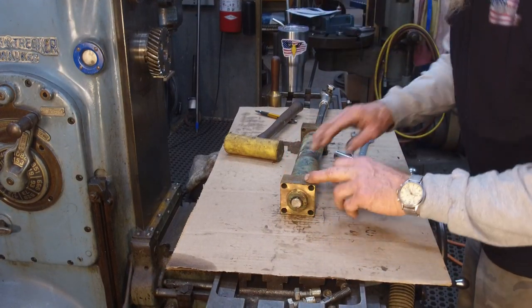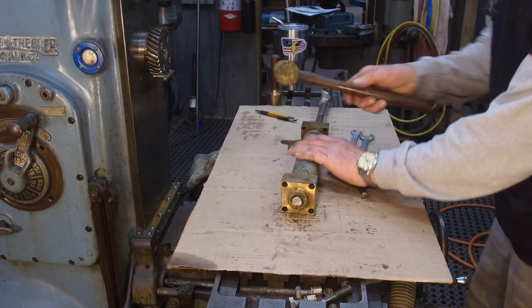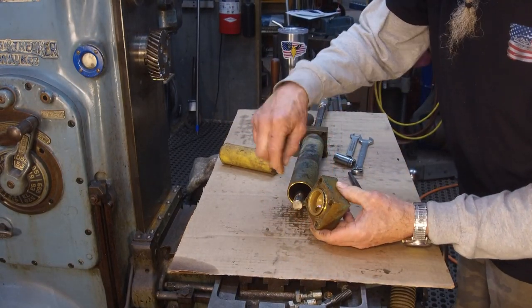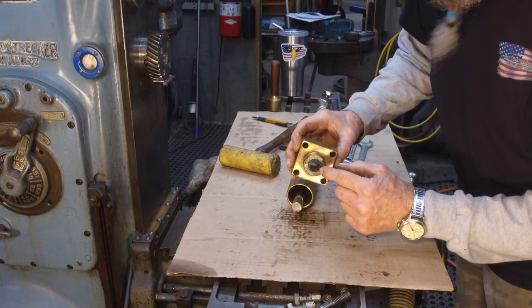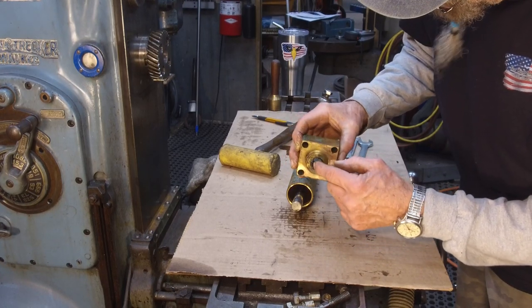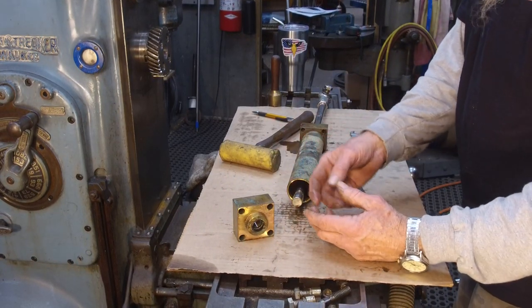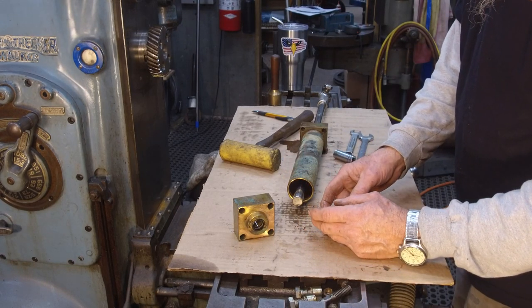Okay, so we got one end here, and then a rod or a tube, and another rod end cap over here. All right, so we got an O-ring that seals the bore, and then we have a wiper, and we have another seal in there. We've got to take a scribe and pop those out, and then we're going to tag them. And then we're going to look up in the book and locate those seals.